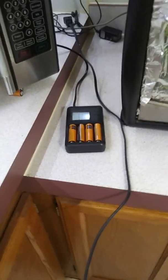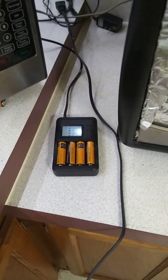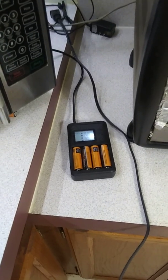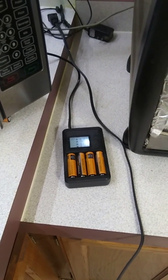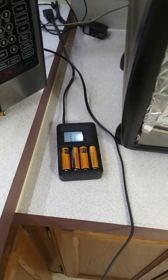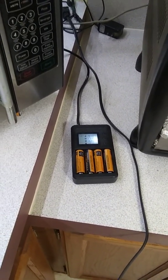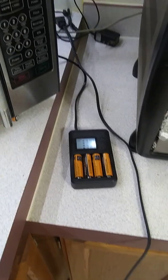But here's Ronnie's tight-ass tips. If you're buying your own batteries, I use nickel cadmium, the old nickel batteries that are rechargeable, but when they're fully charged, they're only 1.31 volts, and they'll last about 30 seconds, and you can recharge them hundreds of times, but it don't have enough voltage to run the headphones, so I have to use alkalines. I was thinking about rewiring it so I can run one lithium ion, double A size. It's got 3.7 volts, which in series like these are run would be about correct, and it's got all kinds of amperage, but I'm going to try this first. Something to play with. I can make a video of that later too.